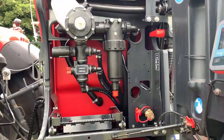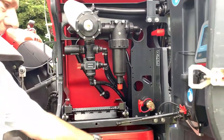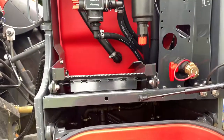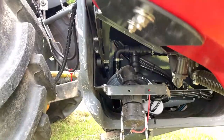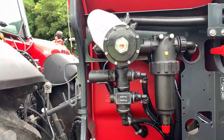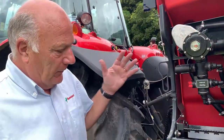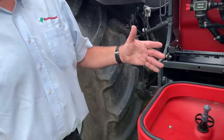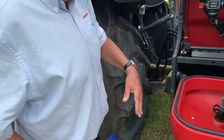This particular machine is an X-Clean Pro, so basically we're using two electronic valves. We have an electronic valve for suction which is positioned down there, and an electronic valve on the pressure side. The machines can come with two manual valves, or we can have an option with an electric valve at the bottom and a manual valve at the top. The valve at the bottom is purely on suction - that determines where the liquid is coming from going into the pump, be it the main tank, the clean water tank, or the external fill.